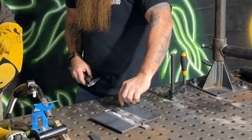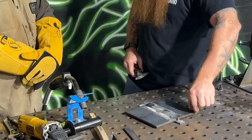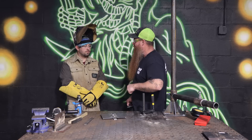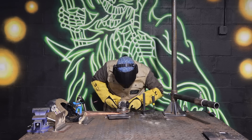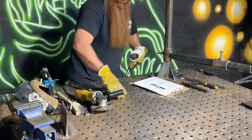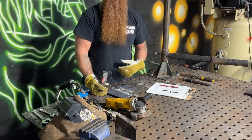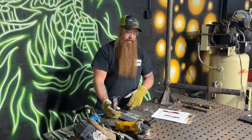So now what I need you to do is clean up three small strips right in here — probably about an inch and a half long, three-quarter inches wide. I'm going to go ahead and transfer your welder number to this plate, so as we do the destructive testing we can keep track of all your pieces. He was assigned a welder test ID number when he came through the door — I'm going to transfer that number to the three spots on this plate so I can retain all sections and not get them mixed up with somebody else's.